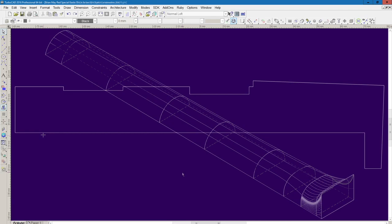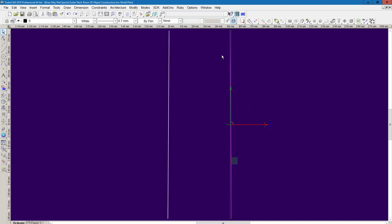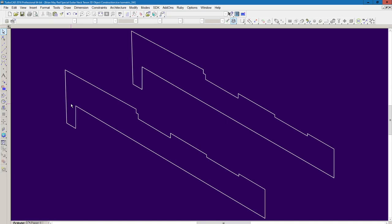I just want to emphasize that the tenon is a dovetail joint, and that these are trapezoidal, i.e. the sides are not parallel. The rebate depths appear to be quite shallow in order to set the correct staggered heights for Brian's original homemade pickups. I estimate that these are no more than 1/16 inch and 1/8 inch deep.